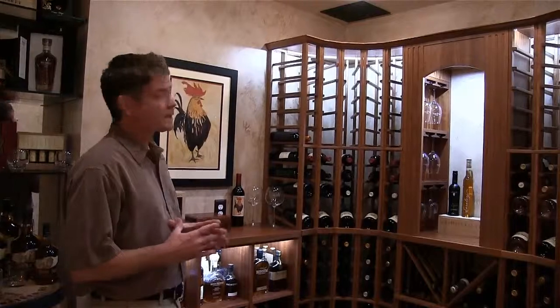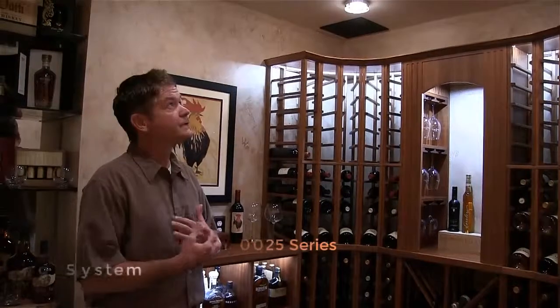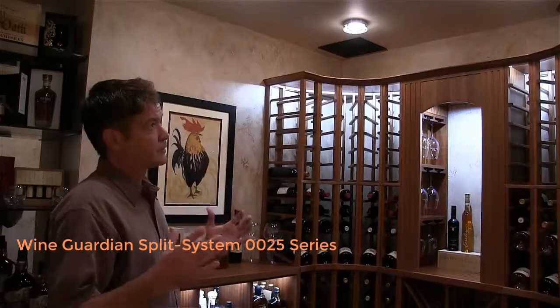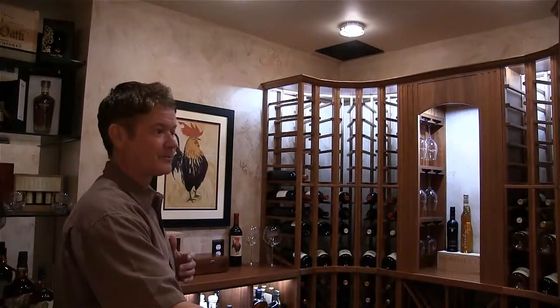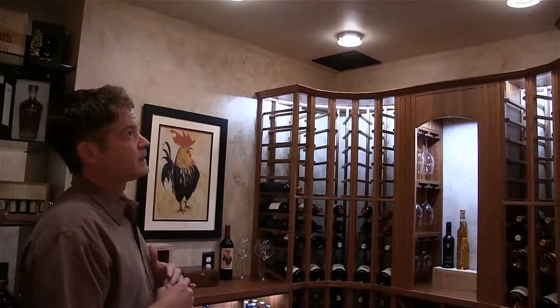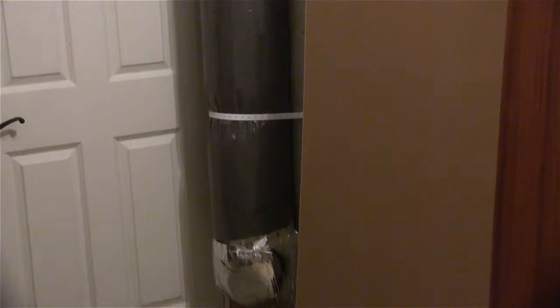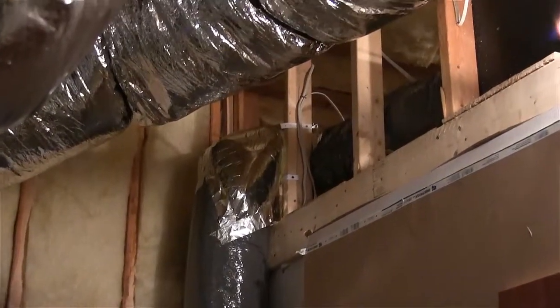This is a Wine Guardian split system — it's a quarter ton, SS025 series. This room was unfinished, so this is a temporary ceiling to create more space in the adjacent mechanical room. Instead of placing the unit on the floor or on the opposing wall, a drop ceiling was created so the unit has enough space to breathe into the other area of the mechanical room. The supply is perfectly located on the back top side of the cellar and the return is at the front side.